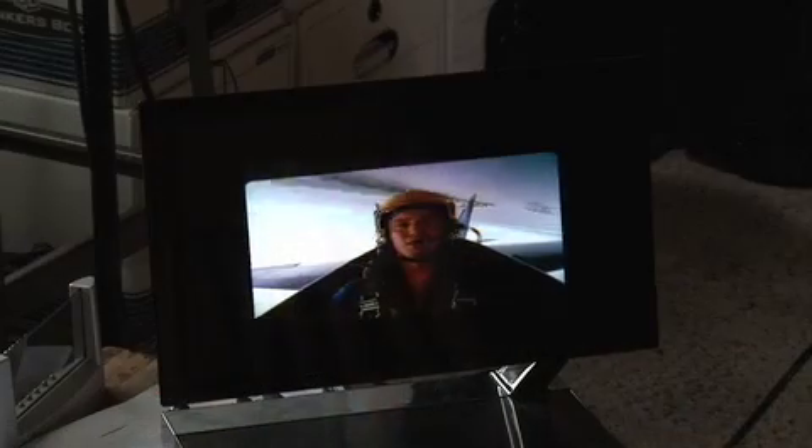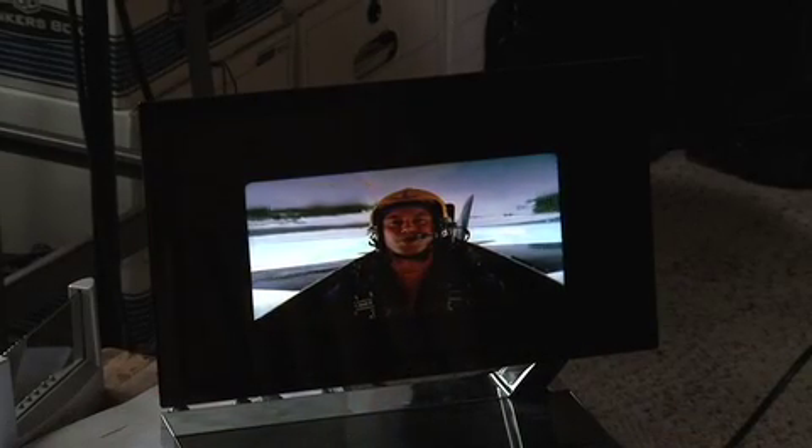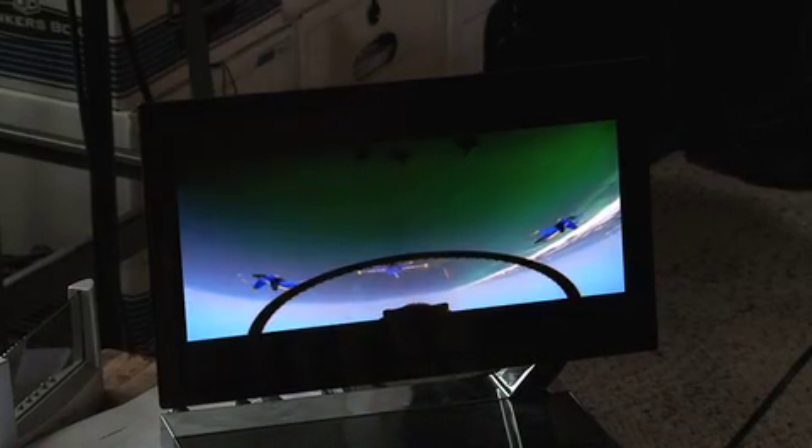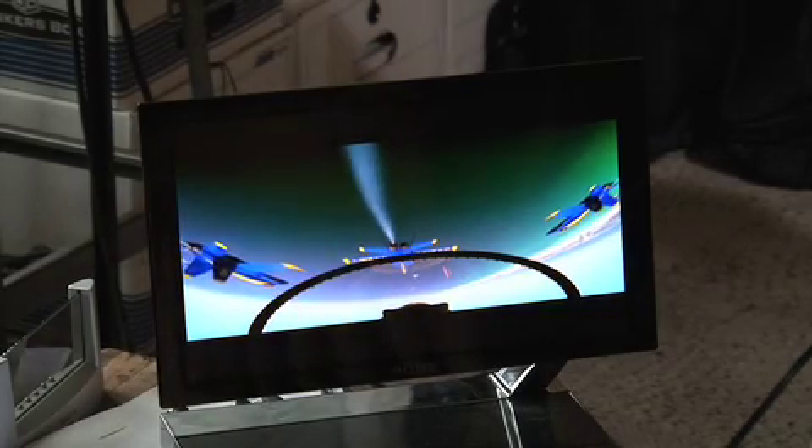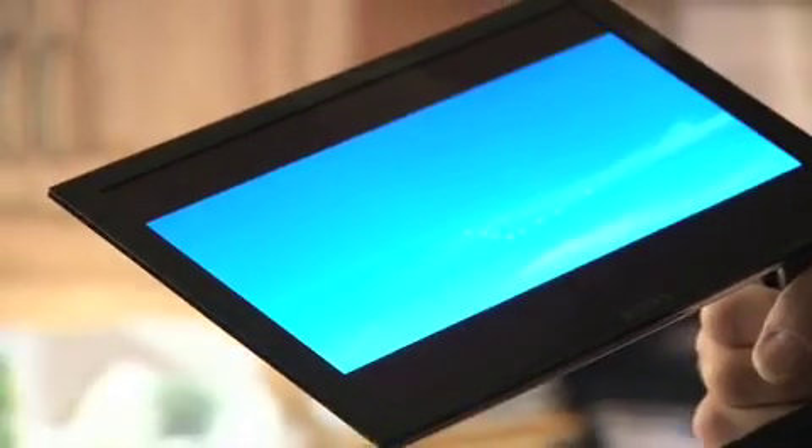It's a very new technology, and there are a couple of technological scaling-up challenges that still need to be overcome. The actual display is 0.3 microns thick. That's just to give you a sense of scale — your hair is 50 microns in diameter, so this is on the order of one-hundredth the thickness of your hair. With a film like that, you do not need a very thick substrate. Indeed, this whole device is only 3 millimeters in thickness.